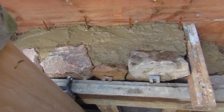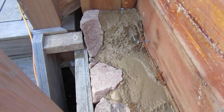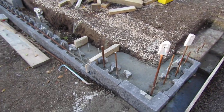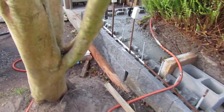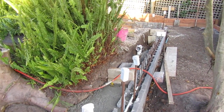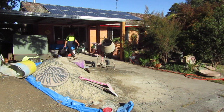We've got another layer of stone up today with this new brace — a good batch of stones in on this pour. I'm just using up my leftover cement in the corner over here. That's the base of this end of the wall, so now the wall's just going to go up. With the entire footprint of the wall complete it's just a matter of laying all the additional courses on top of the block. We have four courses to lay and I'll be going through the procedure of that in coming episodes. In the meantime we're going to need more block on site, which will be a lot easier now that we have the gravel ramp.